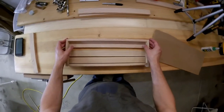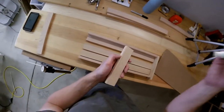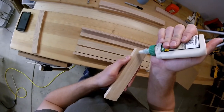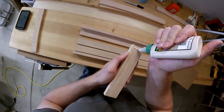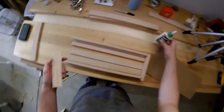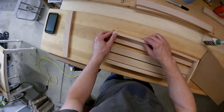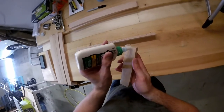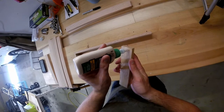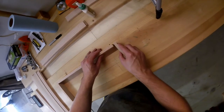Because the piece is not holding a lot of weight or being moved much, I decided to simply use wood glue to fasten it together. I didn't use joinery for simplicity and I didn't want to use screws. Before gluing it is smart to line the pieces up and make sure that they are even. Apply a liberal amount of glue.